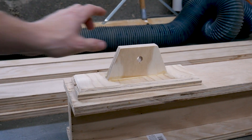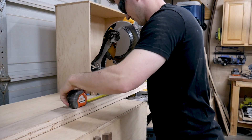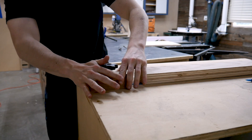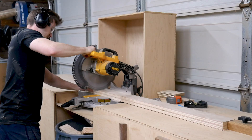We just finished building the mounts — those are ready to go. I'm not going to attach them yet to the top of the beam; I want to wait until I get the beam in its final lateral position, so I can mount them in the proper place and get everything nice and perpendicular to the roof. The next step is to build the actual adjustable height pieces that are going to mount to the roof. I already ripped down those strips at the table saw, so the next step is to break them down to their proper length at the miter saw, then head over to the router table to route out grooves that will allow these to slide up and down.